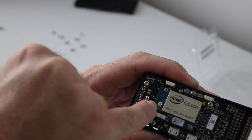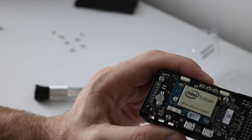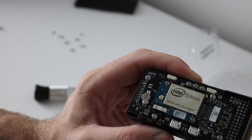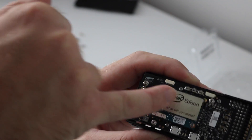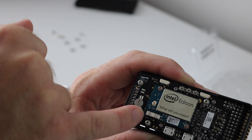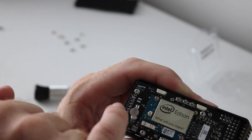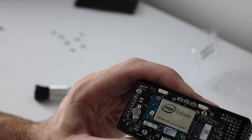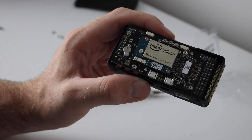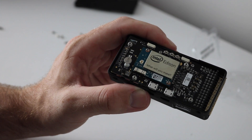There is a port on this Edison for connecting an external antenna; however Intel say do not use it — it is for testing purposes at the factory only. There is a modification that's been posted around where the antenna lines that come out of the Edison go into the antenna connector through some small components to the Wi-Fi. What they're saying is if you remove one of those small components that are in line, you can then use the external connector port. I've seen varying messages on whether it works or not, so I'm not going to try it personally — not yet anyway, but it might be something I do in the future.